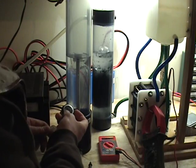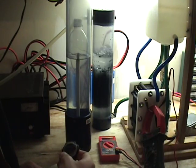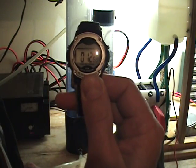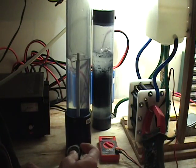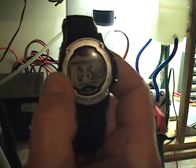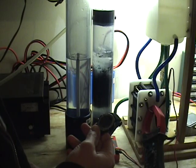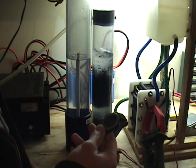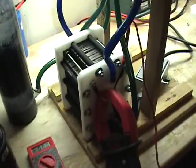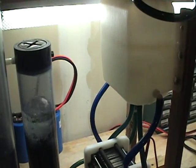I'll start the test now. It's a little over 15 seconds. So we're making about 4 liters of gas at 4.3 amps and 129 volts. This is the new 59-plate cell that's available on GreenFuelH2O.com. Stop by and check us out.